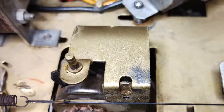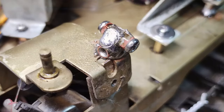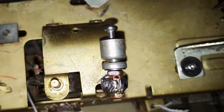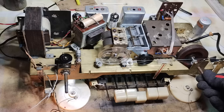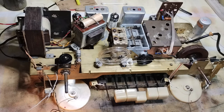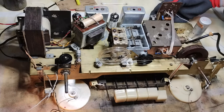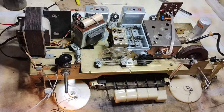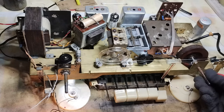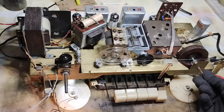It was necessary to accompany the dial cord to the additional variable capacitor drum with an extra pulley. Two standoffs soldered together in a creative way were used to hold the new pulley. It was impossible to obtain a perfect synchronization of the two variable capacitors. Therefore, the new drum needed to be driven only by friction. For this reason, the dial cord was replaced using very strong fishing wire, diameter 0.6 millimeters, relying only on its elasticity, without springs.